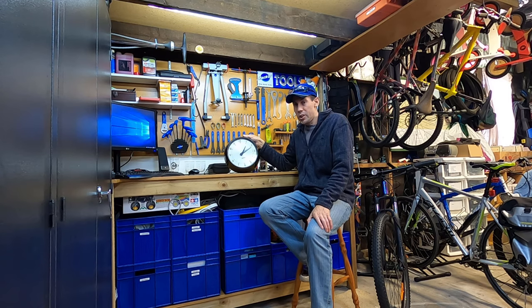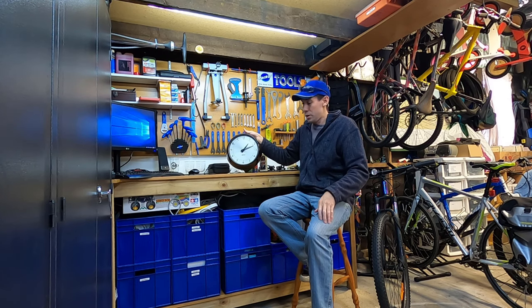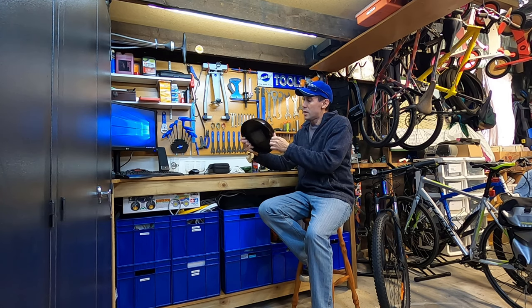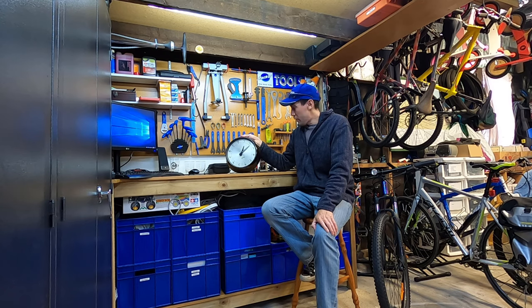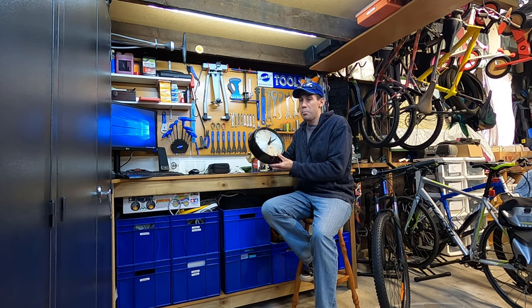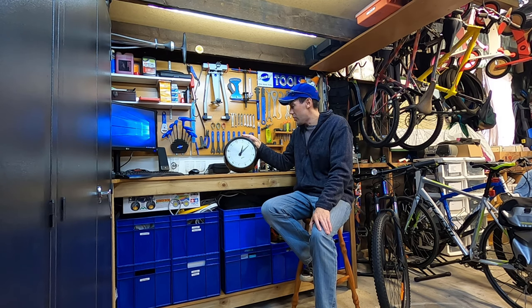That's a wrap — thanks for watching. Quite happy with how this clock's turned out with the Brasso; it does a good job polishing up Bakelite. One thing to watch: when using a heavier grade polish, make sure you don't leave a big scuff mark in the Bakelite itself — Brasso is pretty light on Bakelite so it's not a problem. Also, this clock will need a master clock to run. This slave clock doesn't have a timepiece in it as such — it works off a master clock that sends a signal and moves the minute hand. I don't have a master clock, but keep an eye out — I might try to make one or source an old original one.